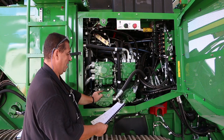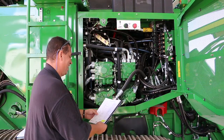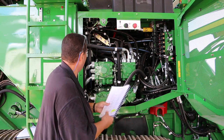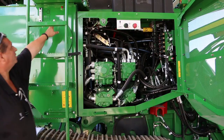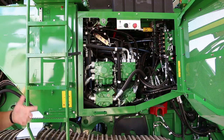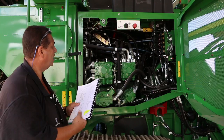Moving on to the rest of the pumps — elevator, elevator feed roller, and knockdown are controlled in here. Back right, just behind over here, there's another big pump — we've got topper and cooling fan in there as well. That gold block up there is a release valve for your hydraulics. Any work you do on your hydraulics, please remember to use this pressure release valve before you touch anything, because your hydraulics are under pressure even when the machine is turned off. Rather than hurt yourself, just be aware of that. We've actually got little booklets to give you that have a breakdown of all the pumps.